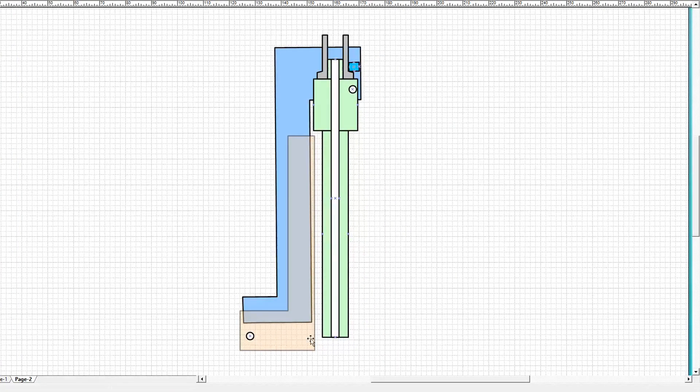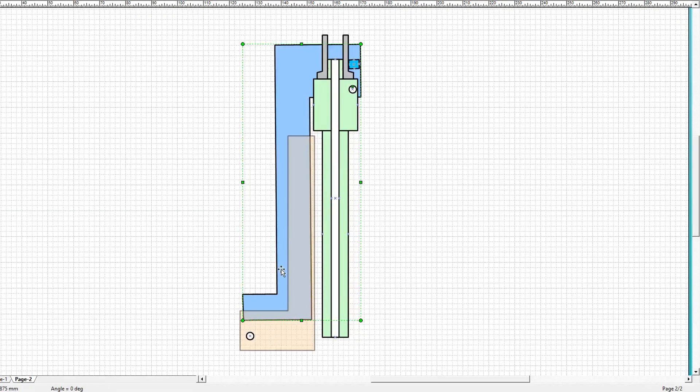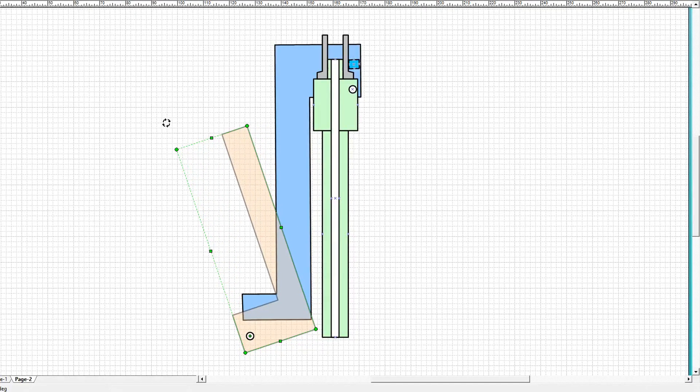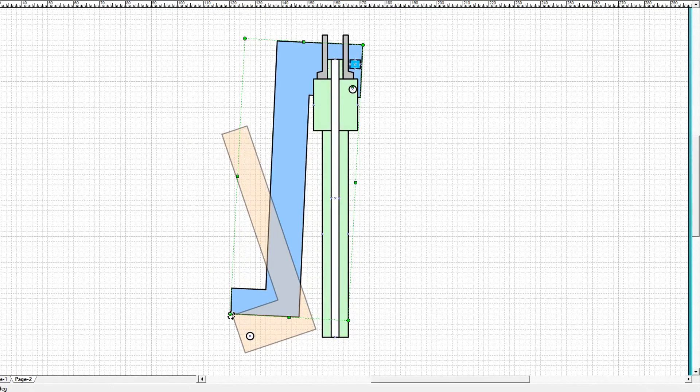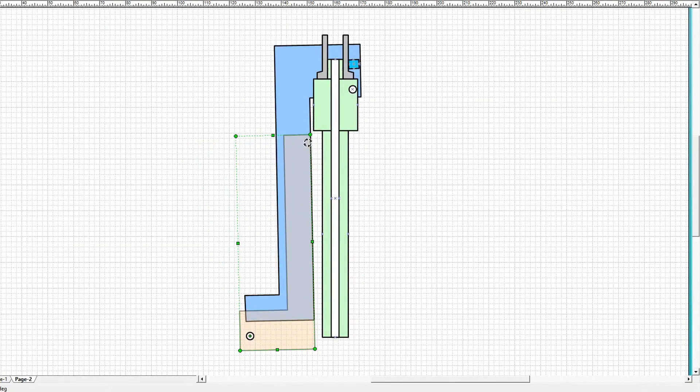Here's basically how we fixed it. We moved the pivot point for the secondary lever from one side to the other. We also got rid of the slope on the primary lever. This meant that the secondary lever could move up but would still be blocked — there was no way for it to slide out. Moving that pivot also meant the lever had to travel much further — at least 20 degrees — before it would ever come out of the secondary lever. So all that was needed was to create a new primary lever and move that pivot, which allowed the whole mechanism to work under various loads and stretch.